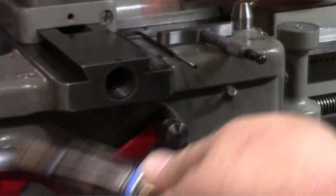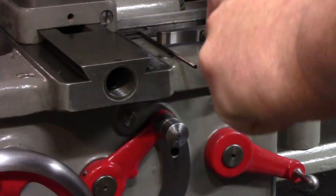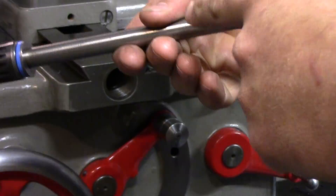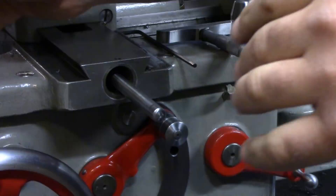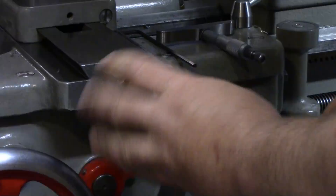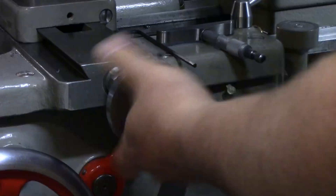We're going to do a quick fit-up, putting our handle in there. We want something that's nice and straight, so this is actually ground stock — a piece of half inch ground 1018. We're going to fit this in place. I know I'm probably going to have to take a little bit off because I rounded that measurement I did first, so we're just going to see if this binds at all.